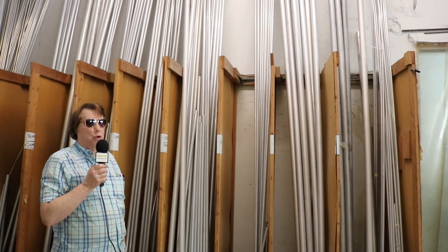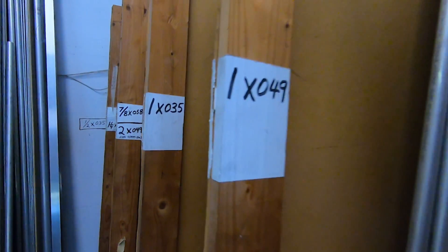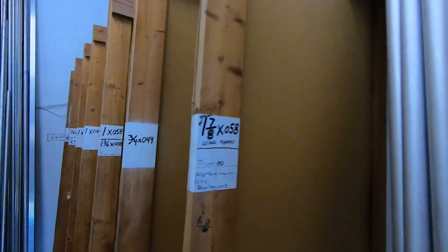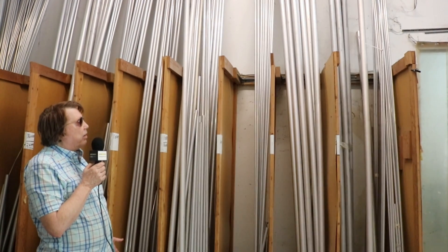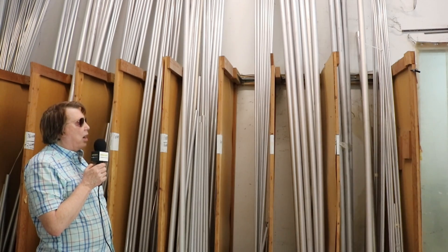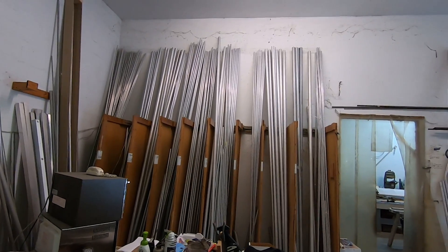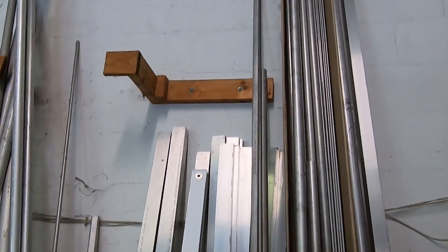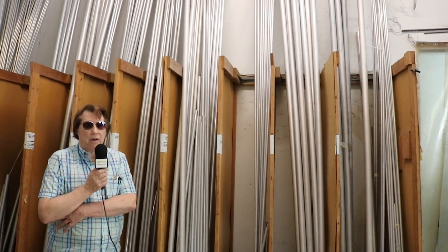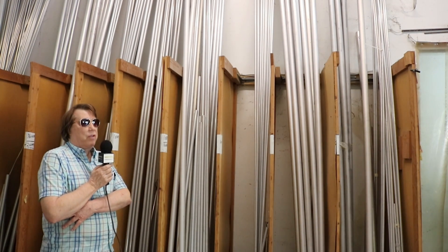At Excalibur Aircraft, since we're an FAA pre-approved home-built kit, we use all aircraft-grade materials, including 6061 T6 aluminum — which is certified. We get certification on all the equipment and tubes we buy for the aircraft. Behind me you see various sizes from 2-inch diameter tubing down to half-inch. Most tubing arrives from the mill in 12-foot lengths. We also use 2024 T3, which is an aircraft-grade aluminum, and on the landing gear, everything is chromoly steel, which we TIG weld as required for aviation.